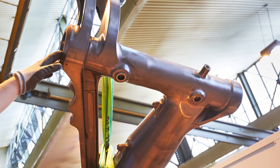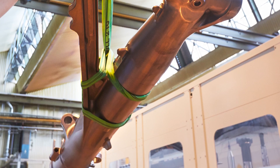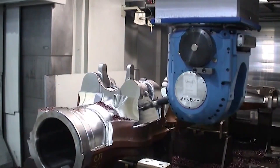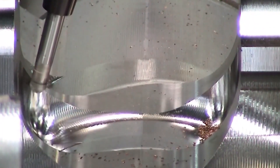Well, that's a bit of a misconception there, Mark. A lot of landing gear cylinders have an integral support leg that attaches onto the braces or actuators, which means they can't just spin on a large lathe-type mill-turned machine as you suggest. Only the real cylindrical components are turned. So this means we're faced with producing very high-value, very complex shapes on milling machines, usually produced from large forgings, and milled all over. Our customers really demand very high productivity whilst also maintaining extremely high quality.